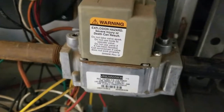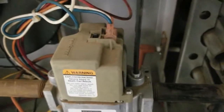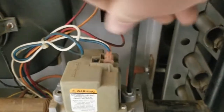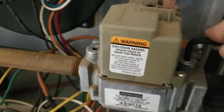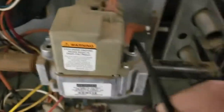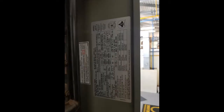Once you have the two access ports back together and you have your gas inlet pressure and gas outlet pressure, you can check the unit serial number plate. It will tell you the correct operating pressure of the machine to make sure everything is lined up and working properly — there is the gas pressure recommended minimum in and out.